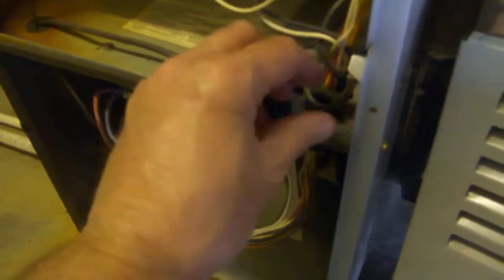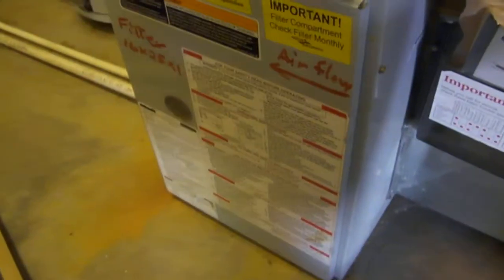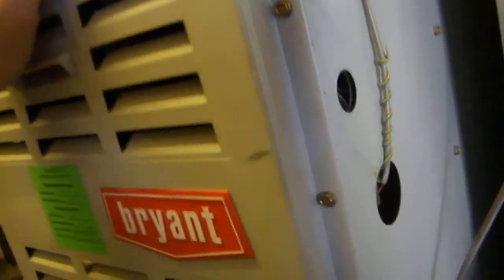There's a little safety switch here — this door keeps that switch depressed, so the furnace won't operate if the door is missing. Check to see that it's tight — all the way on, top is not loose, bottom is not loose. Then put the top panel on; there's a little lip on the inside that slides down over the other side of that lip.